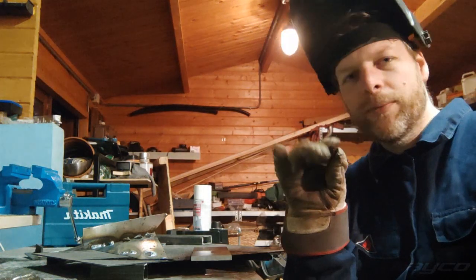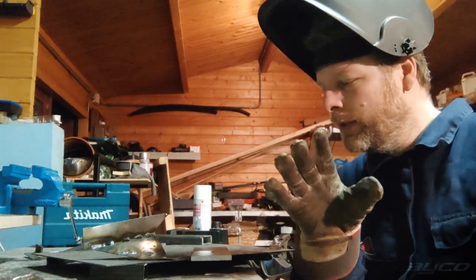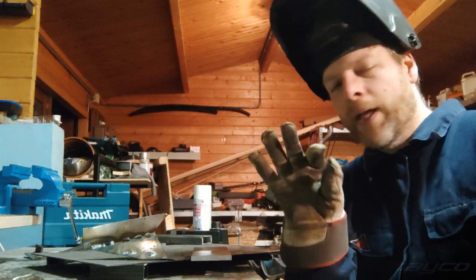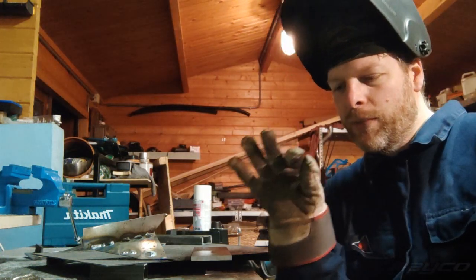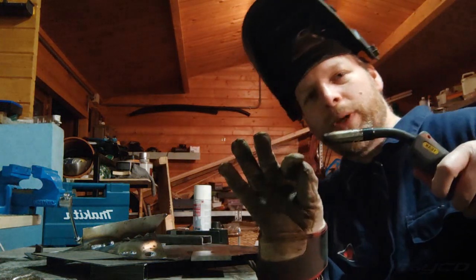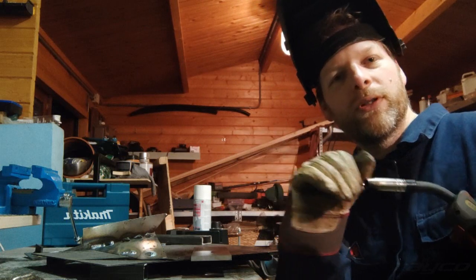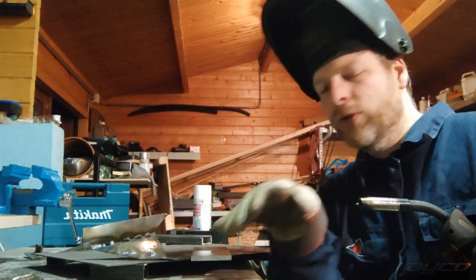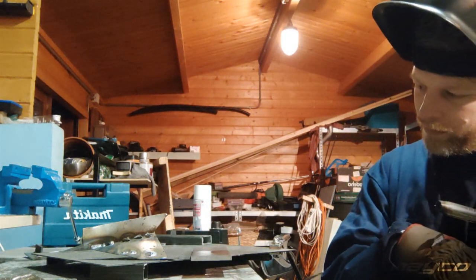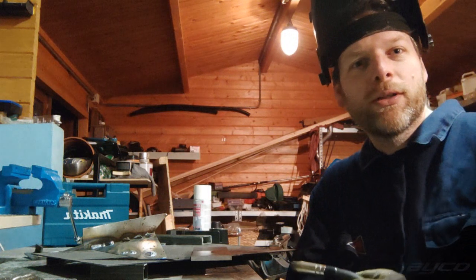If you look very closely, this welder cannot go above 25.5 volts, so if it's 26 volt I haven't said anything. But in my welding course we went to 26 volts, 27 volts sometimes, and then when you weld you can actually see the wire of your torch basically spit the droplets into the weld, and it's very, very interesting to see. I don't expect that to happen now here, but at least I would say this is 6 or 8 mil, and let's try and see what happens.